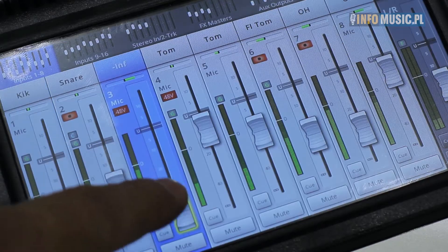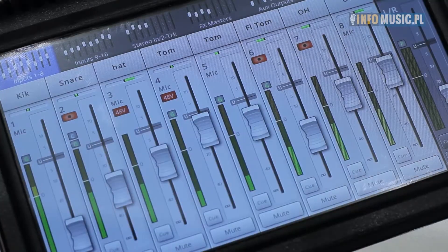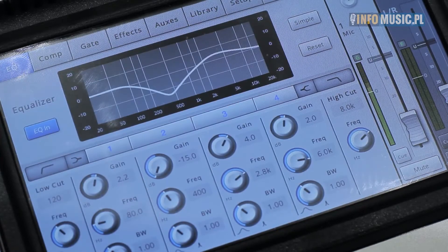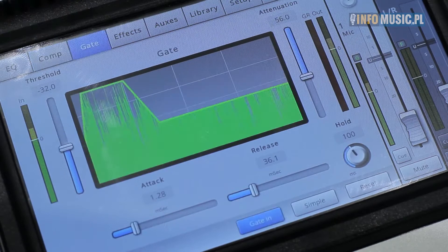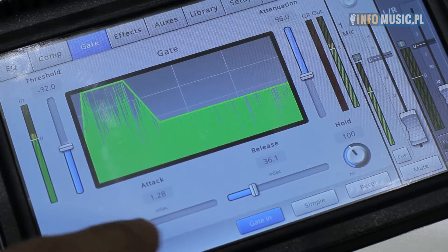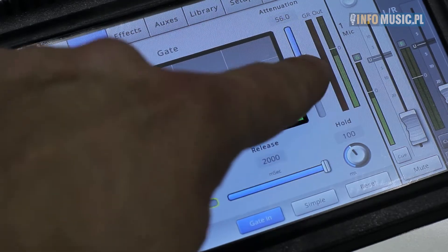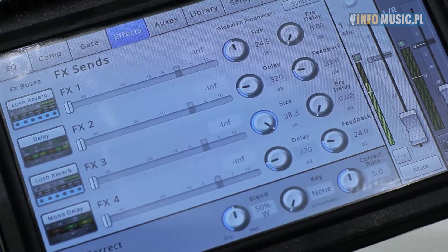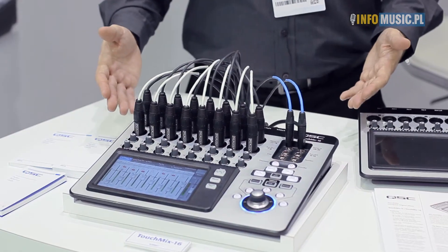With the beautiful touchscreen, you have the ability to access all the dynamics channels. All 20 channels have EQ, compressor, and gate. All your outputs have limiting and graphic EQ processing. You've got 10 total auxiliary outputs, 8 DCA groups, and 4 master effects channels that you can run 6 different effects from. So you have all the versatility of a large format console built into a small design.